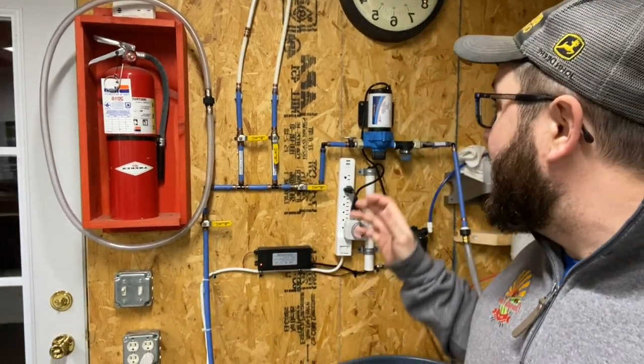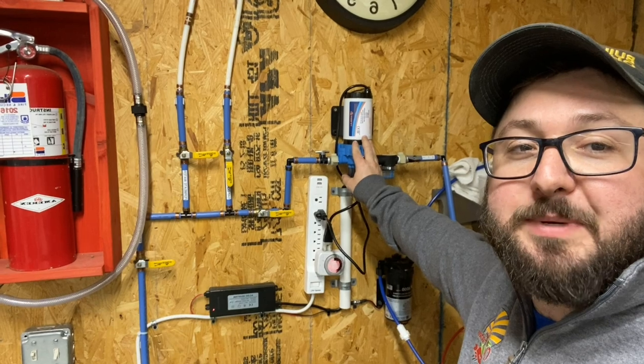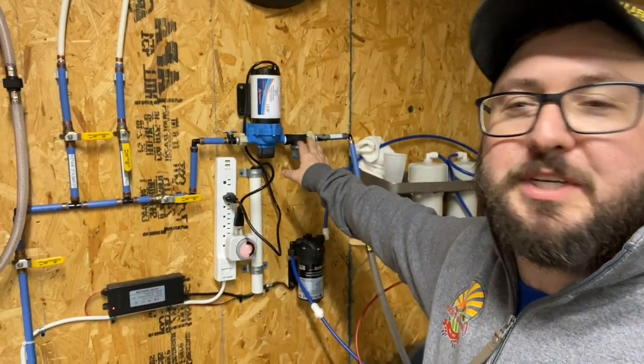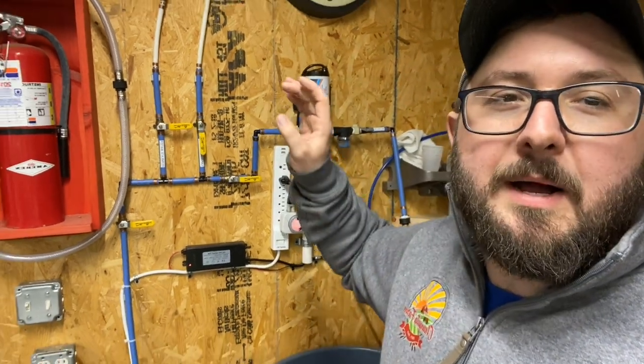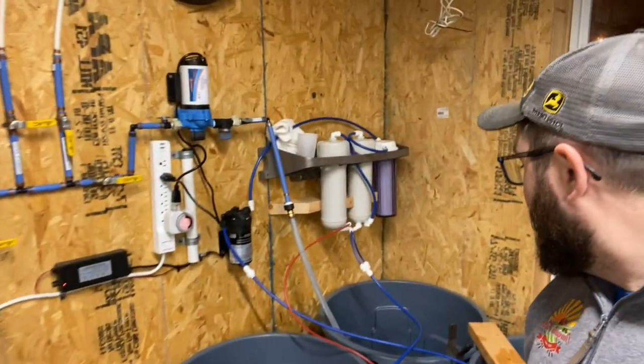As you can see, it really is not a super complex system — nothing but PEX connections and a few ball valves. This pump was about $69 on Amazon and was the most expensive piece in the transfer system. As I mentioned, it is much quieter than the Harbor Freight transfer pumps, and it's heat-rated so we can pump hot water through it for sanitation. It has a pretty good flow rate — we've moved almost 25 gallons of sap in not quite 10 minutes. Hope you enjoyed this quick video; if you did, hit that thumbs up, subscribe to the channel, and until next time we'll see you.